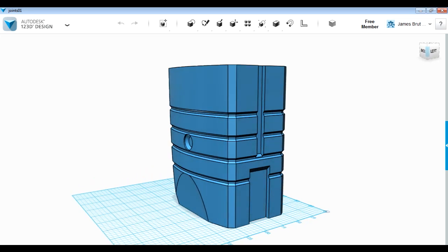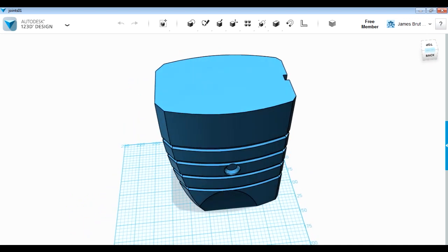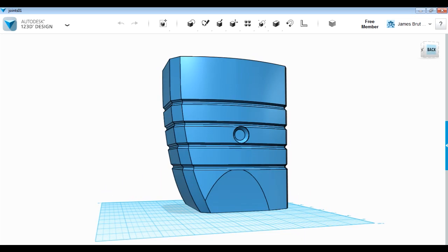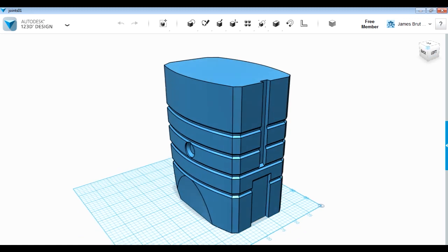The reason I haven't cut that scoop out in the CAD model is because this is going to be printed upside down - printed with a bigger base and a smaller top. It's going to be printed in Ninjaflex rubber, which is quite bendy, so as the print goes up it gets bendier and bendier, making it harder to lay new layers on top. It's much better to have a big square stable base and a smaller top. We'll cut that scoop afterwards in real life once we've printed the physical item.